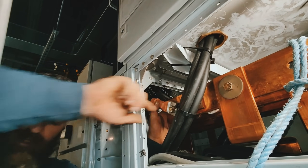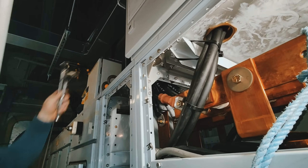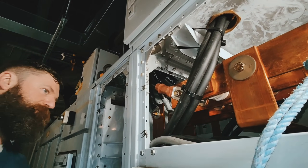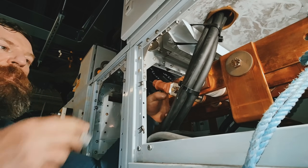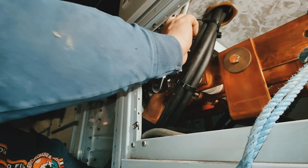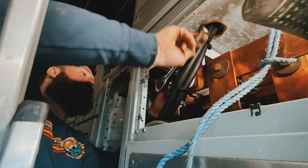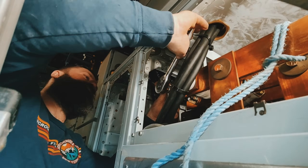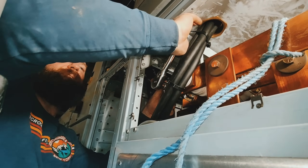What I would like to say to people who are designing jobs: did you see how easy that was with 300 mil? We're not wrestling and breaking our backs or anything. So instead of doing four cores of 300, 400 mil - or even 240 sometimes - just have a think about using single-core cables to make life easy for everyone.